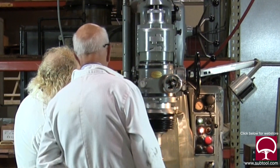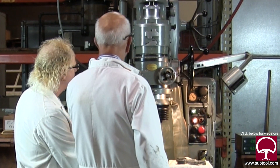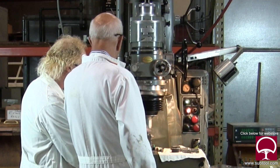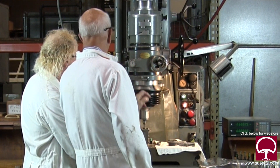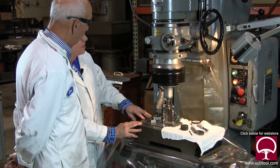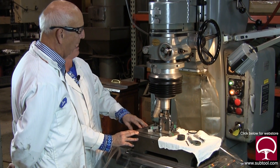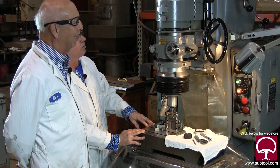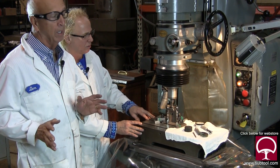This stop — it's not even in play right now. What it's for is if I had to come down to a hard stop and I didn't want to go lower than a certain point — say to grind a face — I would set that stop to do that. Who makes this? It's made by Moore. They've been around probably since the 40s, and to my knowledge there's no more precise machine made in America than this one.